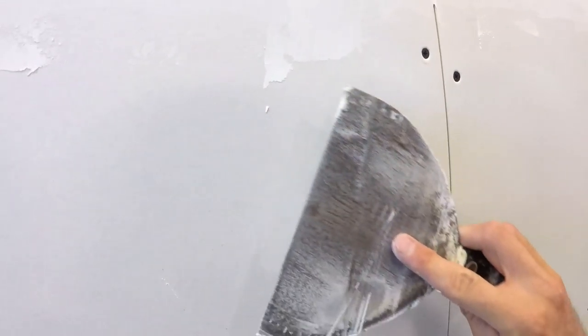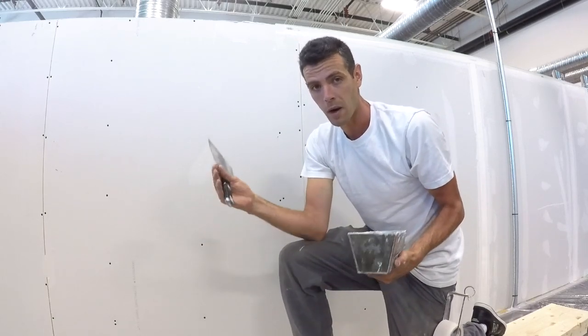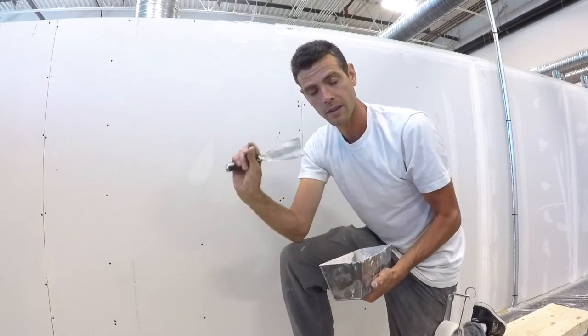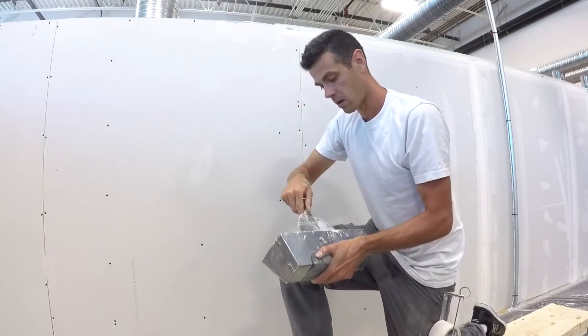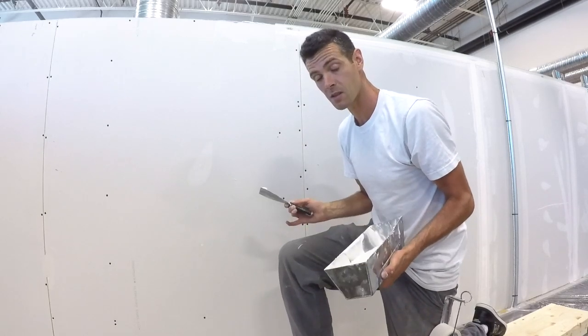So I don't think I had a bubble in either of them but let's try again. Splarp it on, take it off. Pretty sure there's a bubble in that one. You can see the X but I'm sure there's no bubble in there. Okay so why this really matters is you don't want a bubble in that screw because what's gonna happen is you're gonna sand it, paint your wall and then you're gonna see a tiny little pinhole where that bubble was. So in order to get rid of that it's just putting it on in one direction, taking it off in the other, and that seems to solve it every time.